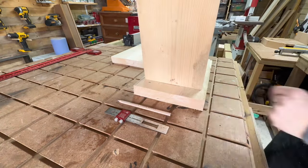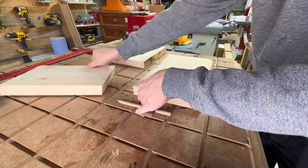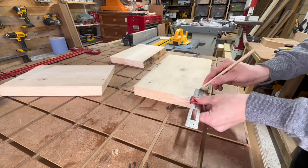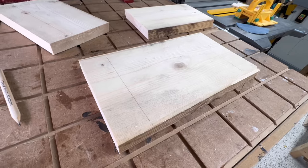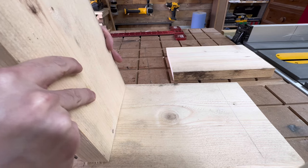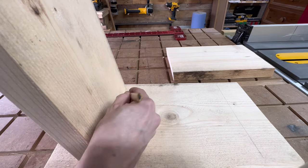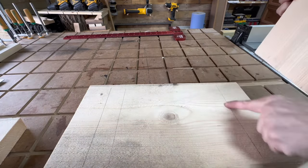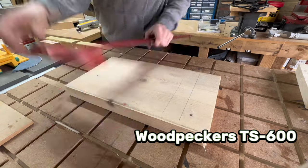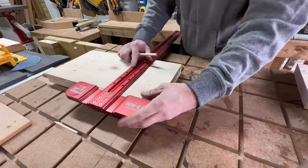On the underside of the seat, we mark the position of the legs. I do this by eye and use a ruler with a depth stop to capture the distance from the edge of the top to the outer edge of the stool leg. From there I can mark two lines that are equally distanced from the edge of the stool top. Work smart, not hard. Using the reference lines, reposition the leg and mark up for the inside of each of those legs. Once we have the two positions locked in, we can mark up for our screw holes. Using a T-square, I mark for the screw holes — I use 5cm from the edge of the stool, but this is personal preference.